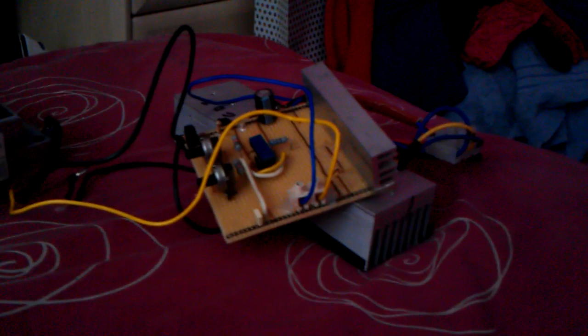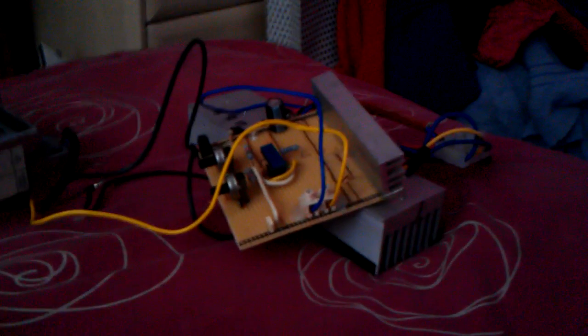I did try the old 555 timer, but it's not as good as the ZVS, and the ZVS is a bit more powerful because you can push more power into it. I do like my toroid. There's a wire coming from the base of the Tesla coil's secondary, onto a wire bar and then onto another PVC pipe down to the base.